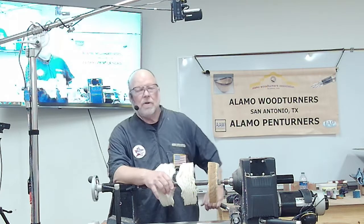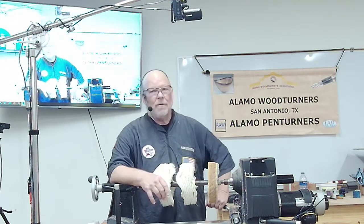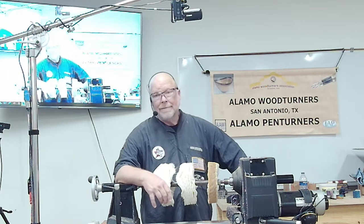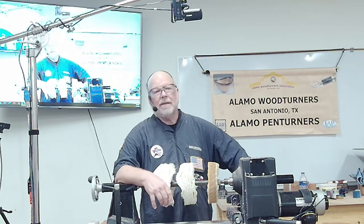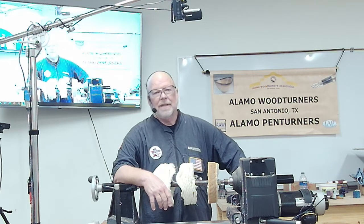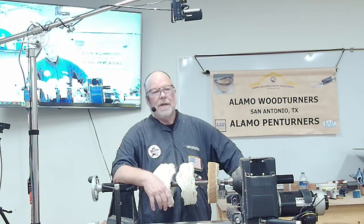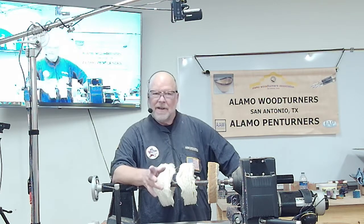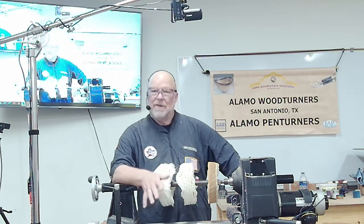I use the ChromaCraft lacquer, but I use several rattle can lacquers and do about 10 coats of that, or I do 5 coats of that, then wet sand to 1,000 to 1,500 grit, then 2 or 3 more coats. And one thing I learned from Jimmy Clewes is that's not a finish yet. You've got to finish the finish.